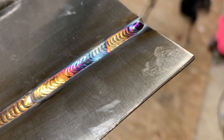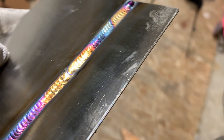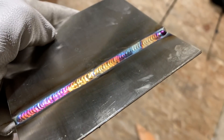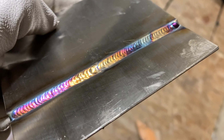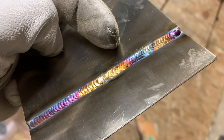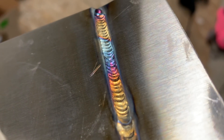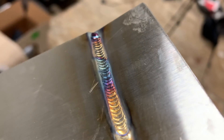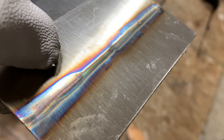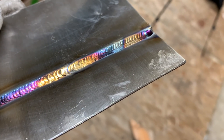Overall I'd say I'm pretty happy with the second half. There is still some color, but hey, we're goofing around in the studio today and just having fun. I did get onto the right track with a bigger cup — I switched to a 12. I could probably have increased the gas CFH; I was running about 16 CFH through the regulator so I could have added a little bit more. But overall we got ourselves a clean weld — no contamination, nothing like that. Everything's looking pretty clean and shiny. On the second half I was definitely trying to increase my filler rod a little bit more, which helped fill it up. The consistency of the width is pretty close — not too bad at all. Flip it over and you can see a reasonable heat-affected zone.